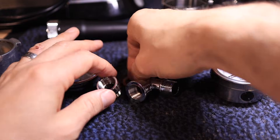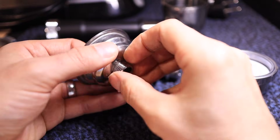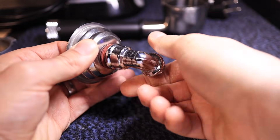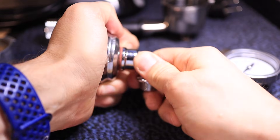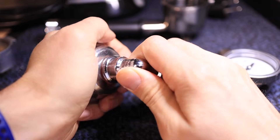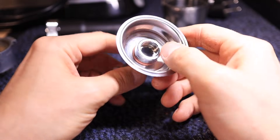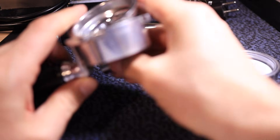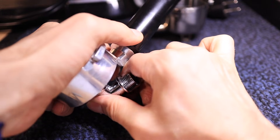It's pretty simple. Put a fabric washer on the reducer and stick it through the hole. Then put a fabric washer on the other side and screw it together. You need to make this quite tight in order for it to withstand the pressure. These fabric washers really dig in and give a nice bite, and if you need to, you can tighten it up with a wrench. Then it just gets plopped into the portafilter and the gauge gets screwed on.